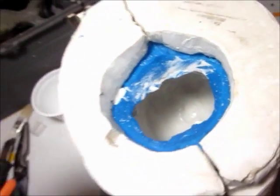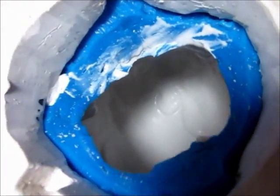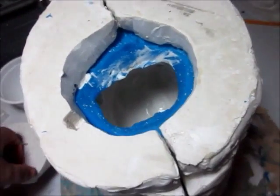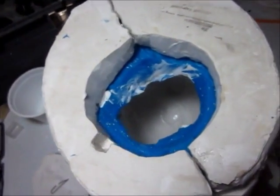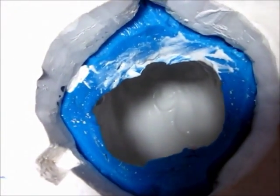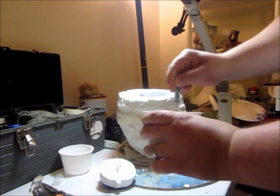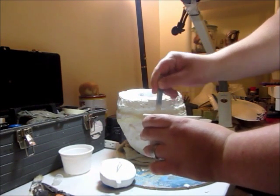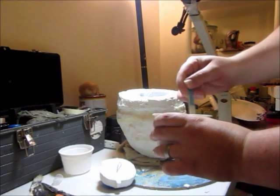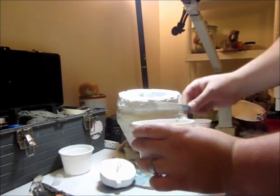On the last one, we'll put in the plug. That goes in here where the key is and just sits right in there. So we'll fill this up with wet plaster, pop this in, rotate it upside down to where this is sitting on the bottom. That way this hole right here will be filled and it should be a seamless casting. The second batch of plaster is going to kick, or cure, a lot faster than the first batch when it comes into contact with the plaster that's already in there. So you have a little less time to work than last time.